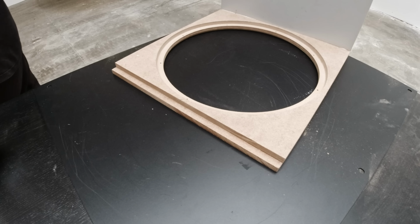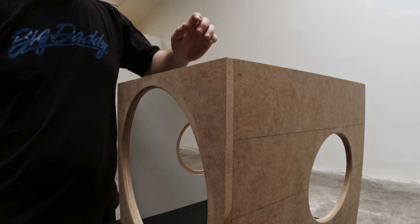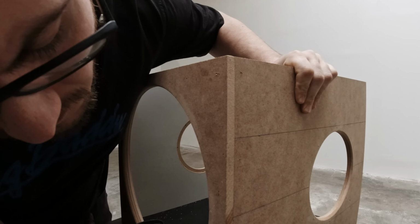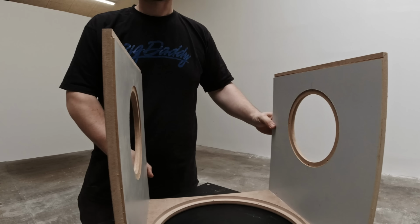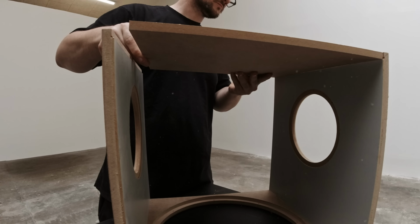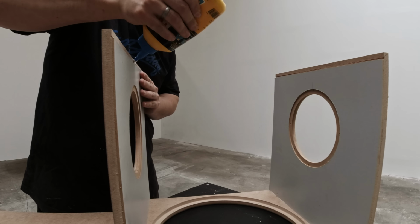I had a lot of ideas with this box, and there's this reverse concept I was going after, and at the same time I wanted to make it a passive radiator, so it didn't have to have this massive long tube inside, so you can make the enclosure a whole lot smaller. The other thing was, when I had two drivers, I knew I would love to place them opposite and have some kind of piece between them, so I can get as much cancellation of vibration as humanly possible.